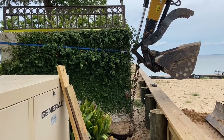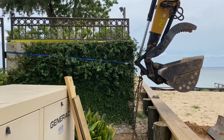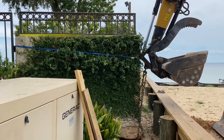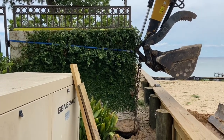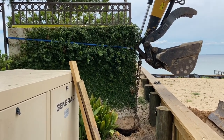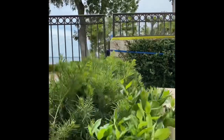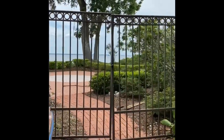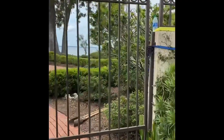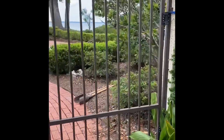That leveled it up — look at that gate close. It looks pretty good; could go a little more. All right, let's hold it there for right now and check the level. We've got the wall leveled up and plumbed up. The gate was installed with the wall being crooked originally, as you can tell, so I'm going to see what I can do to make this gate work — it was actually put on and built for a crooked wall.